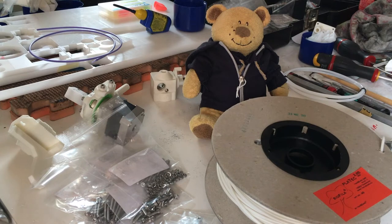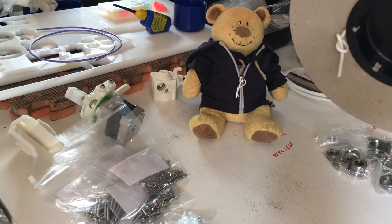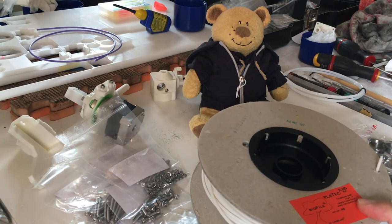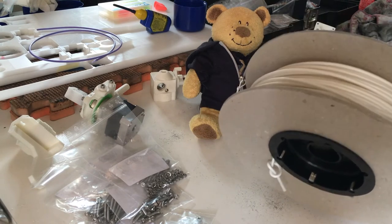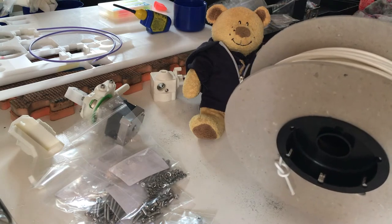So what do you really need? You need to look at the bill of materials, which is very comprehensive and has all what you need. You need filament to print it. The extruder has been designed with either Biofila PLA tech or extruder green tech — filaments that are very easy to print but at the same time are temperature resistant. So it's important to have something that will not melt; you definitely cannot use PLA for that.